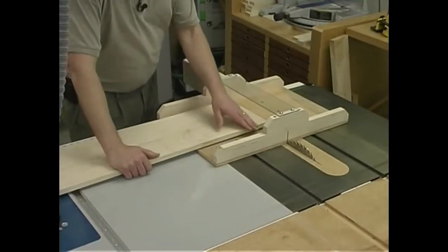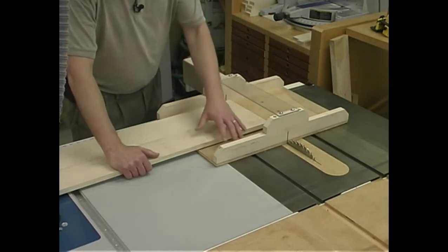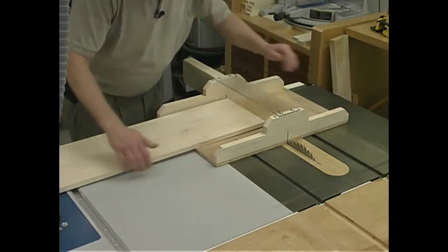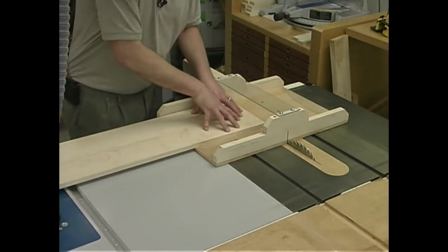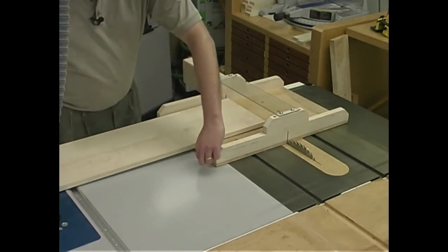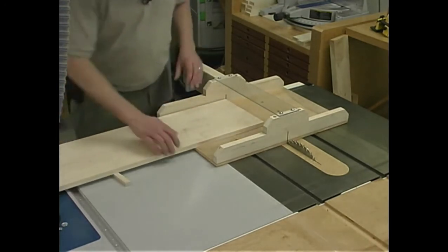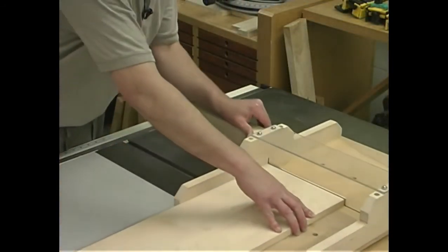Now to do the cross cutting, it's a little bit wider than my compound miter saw can do, so I'm going to be using the table saw. I've got my cutoff sled set up on the table. Now you'll notice my sled's a little bit on the narrow side. To me, it's just about perfect for the things that I do. But it's sometimes hard to hold the board flat on this end because there's nothing supporting it here. Now I used 1/2 inch plywood when I constructed the base for my sled, so I just keep a 1/2 inch thick shim next to the sled so I can throw that underneath, line up my board, and make my cut. Just makes it a little bit easier.